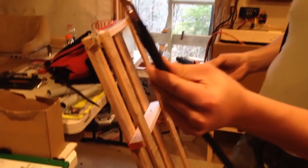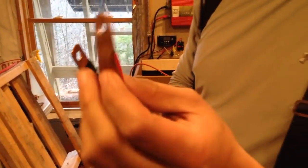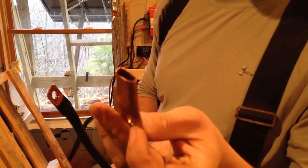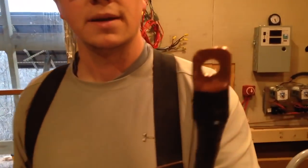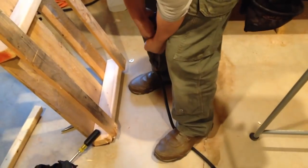This is a customer-made battery cable. There's a lot on the internet showing you how to make a battery cable out of copper tubing, how to make a battery lug, and this is not as good as a crimp connection. Here's one that the customer made. He said it was super good, super tight. Here's how we test our crimps — let's see if I can pull it off. It came off pretty easy.